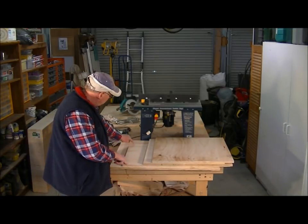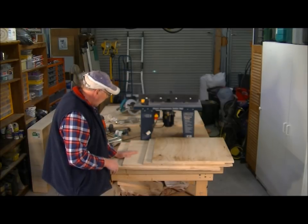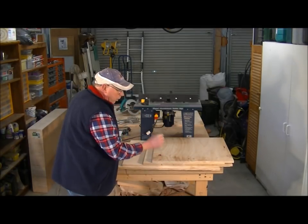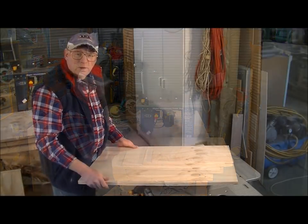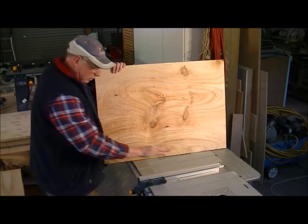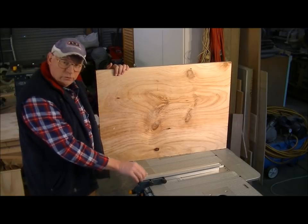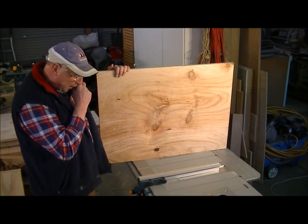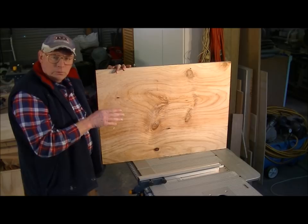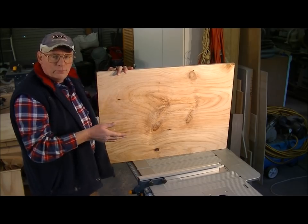What I'm going to do is make rabbet joints around the outside of the sides, and I'm also going to run a dado where I'm going to put the drawers in. Whenever I'm making a rabbet joint, what I normally do is set my table saw to the right depth of the rabbet joint and the fence at the right distance — 19mm — and run a cut first with my table saw, then put the router in, because I believe it just makes an easier life for the router.